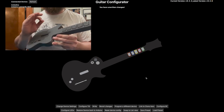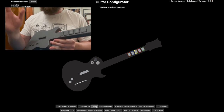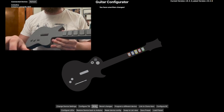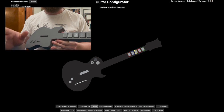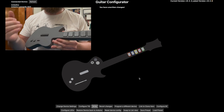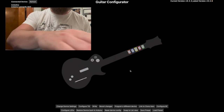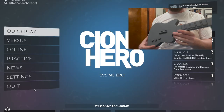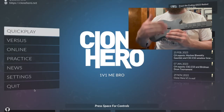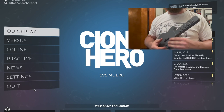As far as things look now, they are set. What we're going to hit now is write — and that's it. This will go ahead and write this to our controller. When it is done, you're going to hear it disconnect, reconnect, and then your guitar is configured. Now it's time to try it out in Clone Hero. All right, everything is connected, everything is mapped, Clone Hero is open and it's time to play. Let's see if this guitar works.